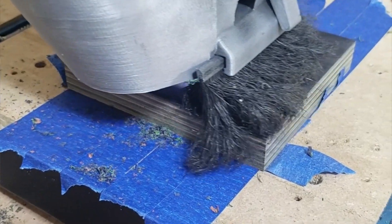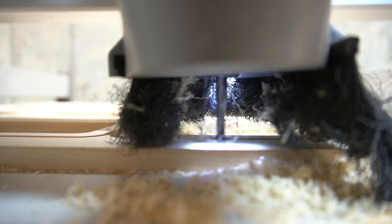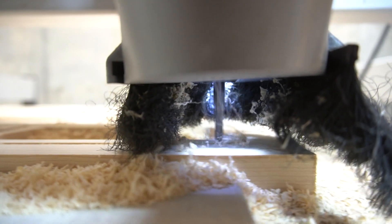Now I cut primarily wood with my CNC. Wood is really forgiving. What you're going for is you want to be making wood chips like this, and you don't want to be making sawdust. If you're making chips and not dust, then you know your speeds are dialed in. Some signs that you're running your spindle speed too fast is you're burning your workpiece. You either need to increase your feed rate or you need to slow down your RPMs.